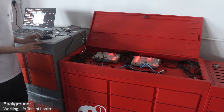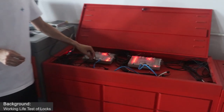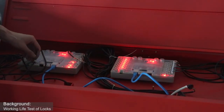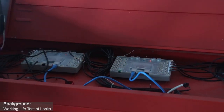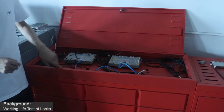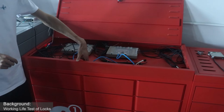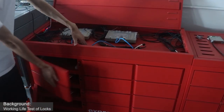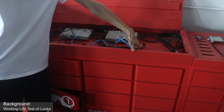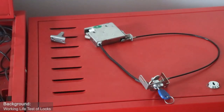We just showed how to use our demo software to open the lockers. All the locks are powered by the power supply. But if power is off, how do we open these lockers? We need to make a special design — we connect all the emergency levers of the electronic locks together. When we open this lever, multiple lockers will be opened at the same time.